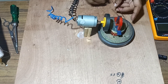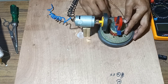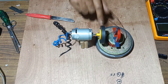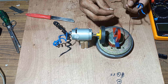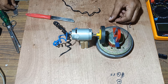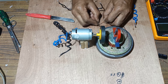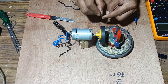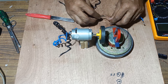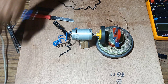We will do the connection of the coil with the terminals and the motor to see how much EMF is generated. We fix two terminals in front of the coil and give the connection to the two endings of the terminal of the coil windings. For that, we remove the insulation of the two terminals to get the EMF which is induced in the coil once the flux linking with the coil changes.